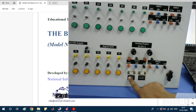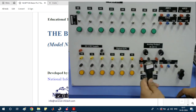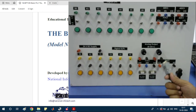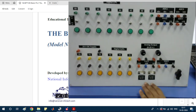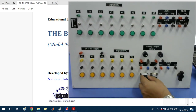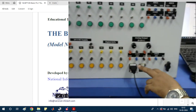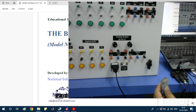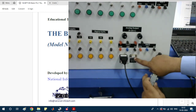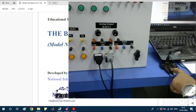These two pins are the communication pins — the communication port. You can connect RS-232 here using this wire. For communication you can also use this RS-485 cable and buffer. If you want to dump any code into the PLC, connect this cable here — this cable connects to the PC, so communication is done between the laptop and the PLC. If you have a communication code, you can use RS-485 here; the RS-485 port connects its output to the PC.